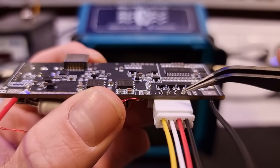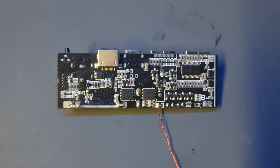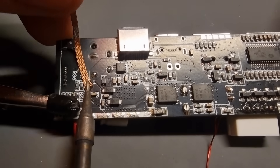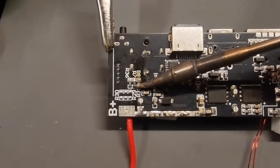It's important that no solder is bridging any of the pins because this will cause a short circuit and will blow the PCB fuses. Another step that isn't entirely essential is to tell the USB board the capacity of all the cells by replacing a little resistor on the back of the board. I can get away without doing this but the battery pack percentage reading will be wrong. I'll leave details on how to select the correct resistor in the description.